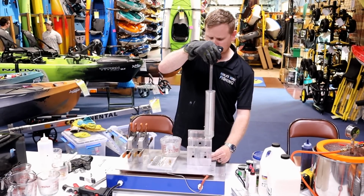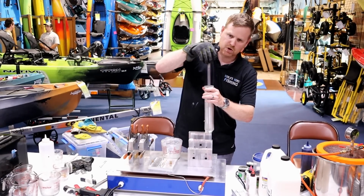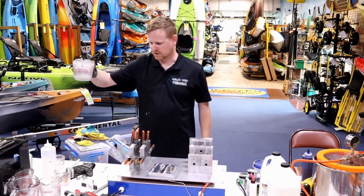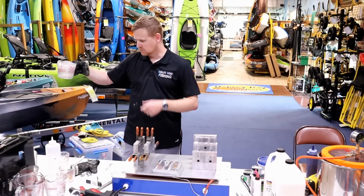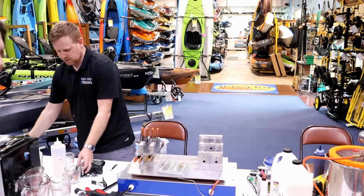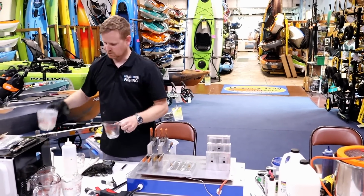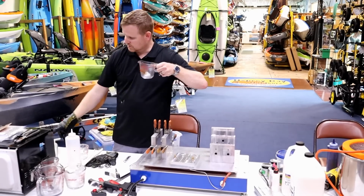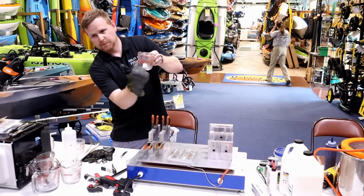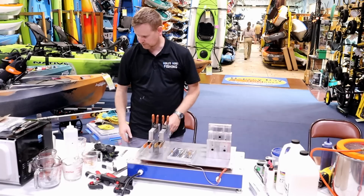The vacuum chamber. You'll just have some air bubbles in your plastic. It's purely cosmetic. So now we're getting towards the end of the life of that particular 2 cups of plastic. If you wanted to get every drop out of this, you would now transfer it to a smaller cup where you can. A quarter cup of plastic in there is going to be taller, so that you can get that injector nozzle down. Just little things there.